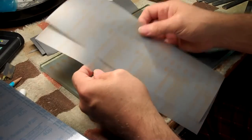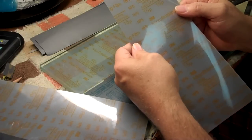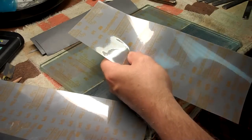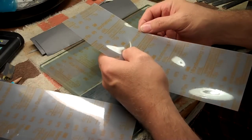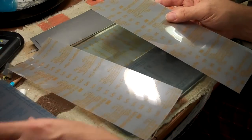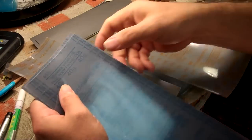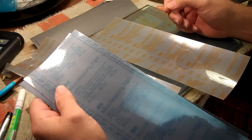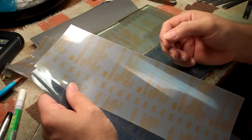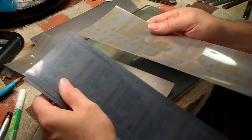The Mylar-backed sandpaper is made by 3M. They call it a micro finishing film. I buy this from a woodworking supply place in Brooklyn, New York, called toolsforwoodworking.com. The two grits that I like to use are a 40 micron grit, which is equal to about 320 grit sandpaper, and a 15 micron grit, which is finer, more like a 600 using the scale used in America. If you're using the European scale, the P scale, it would be closer to a 1200 on that.